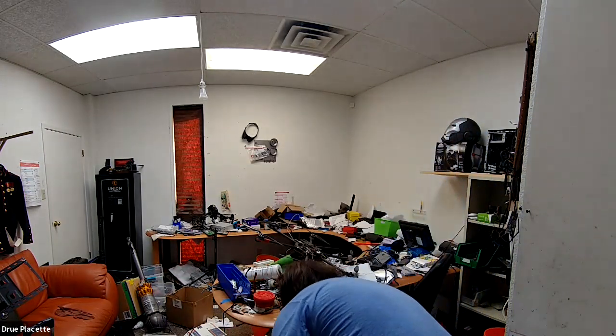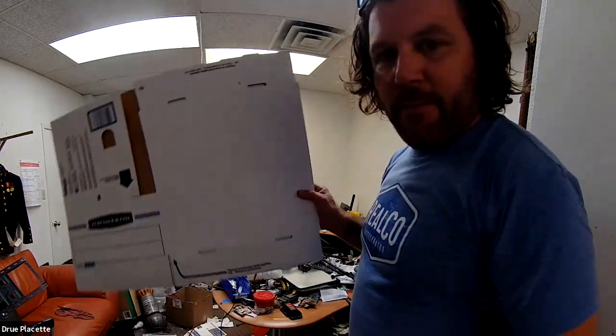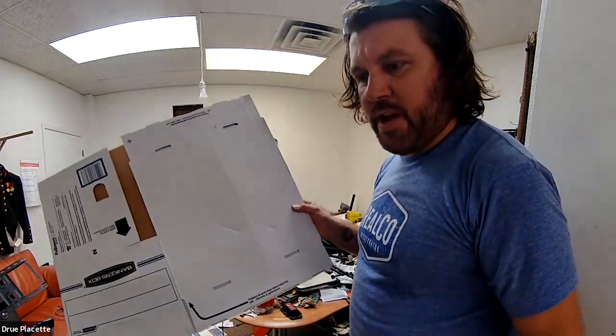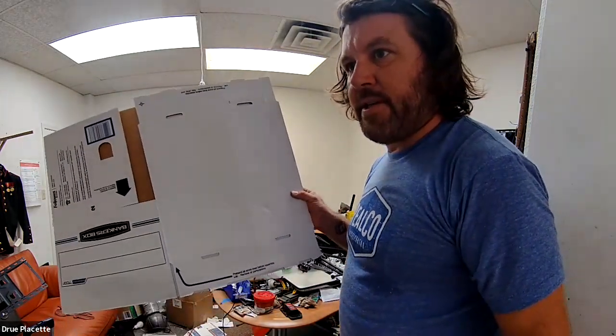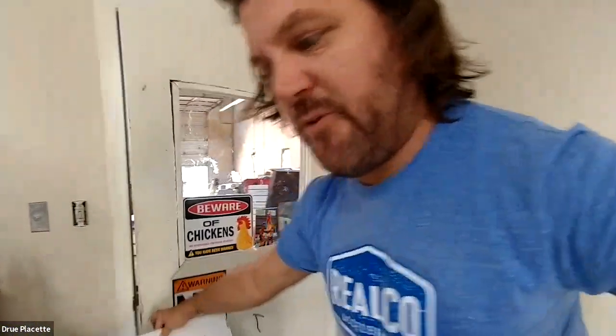If you want to do that, the laser module actually works better than the drag knives. I scrap lots of cardboard, and I use the lasers for cutting it, because then you can also control depth by controlling power. With drag knives, you have to make sure the pressure's right, and they dull fast. If you're doing a lot of cuts, you're going to be replacing those blades pretty often.